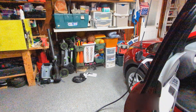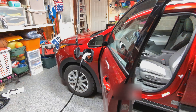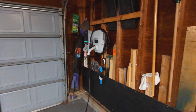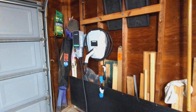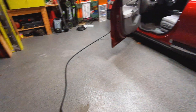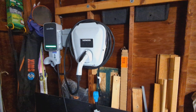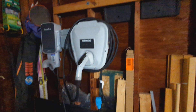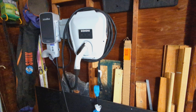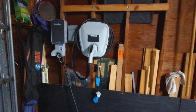Those are what I've been able to accomplish and what I like in terms of charging. The 40-amp JuiceBox — the reason I mounted it out toward the garage door side is that in the summertime this garage is generally full of stuff, so the cars aren't parking in here, and it provides the opportunity to charge in my driveway. The JuiceBox comes with a 24-25 foot cord, whereas the Siemens is only 20 feet, and those four extra feet are noticeable when you're trying to charge in your driveway. If there are questions, leave comments — that's what I've got for now, thanks.